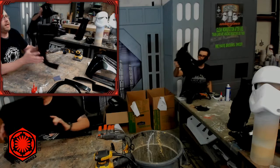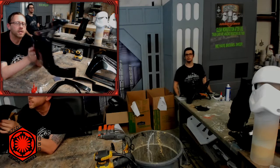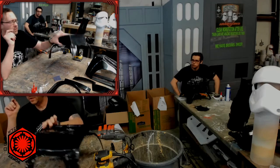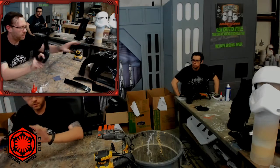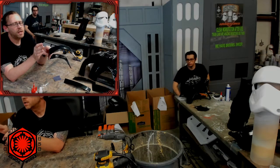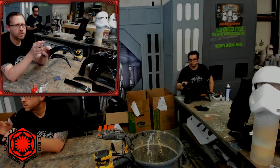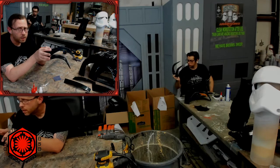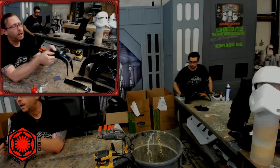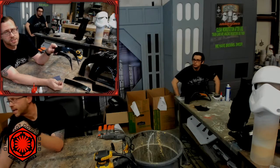All right, so we're on to the back. Just to give you a general idea of how it should look whenever it's trimmed, give or take. I think there was one more thing about the collar. In our mold, there is a crack on the right hand side that helps facilitate demolding the part from the mold, because this is a very, very complex shape. So to get rid of this little perceived crack that you see right here, we're just gonna sand it.